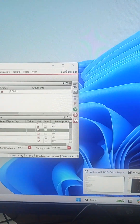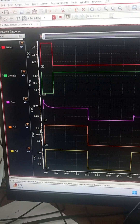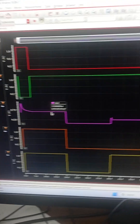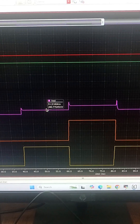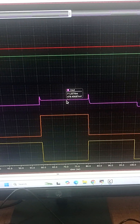Now let us see the results. Initially it will be reset — at the time of reset the output goes to VCM, approximately 676 millivolts. Then for code 00, the output is 83 millivolts; for 01, the output is 280 millivolts; for 10, the output is 478 millivolts.